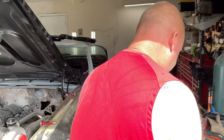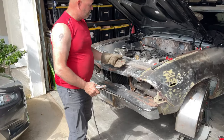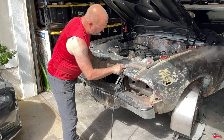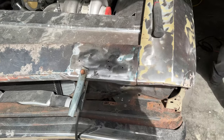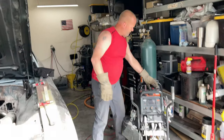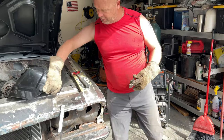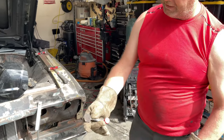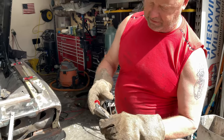All you do is hook up your ground - we just ground this down so you can see that. Now we got a nice ground. Normally when you're welding thinner metals or holes, sometimes you get burn-through. What I like to do is use a backing plate - this little tool. It's brass or copper, I can't remember, but it's magnetic so it just sticks to the back side.